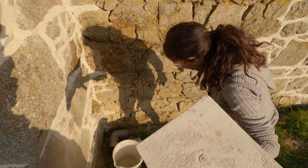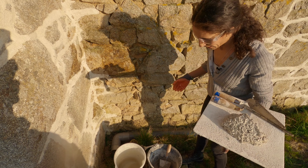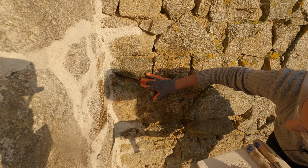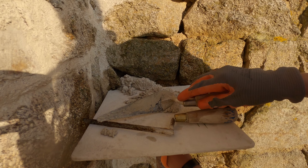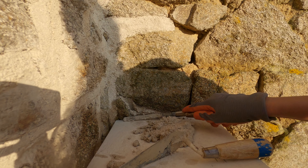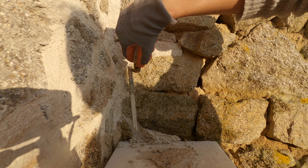I'm going to get my trowel and put some lime here. Normally what I do is use these two trowels, put them next to me so I can move from one trowel to another easier. For example, here I have this quite deep and wider crack, so I use the bigger one to put more quantity in, and then go to the small one and squish it in as much as possible. It's a little bit dirty but never mind — it looks amazing afterwards. We can go when it's dry, go behind it and brush it and make it nicer.